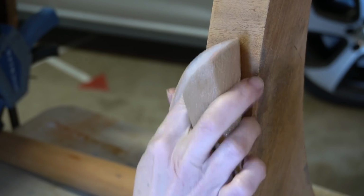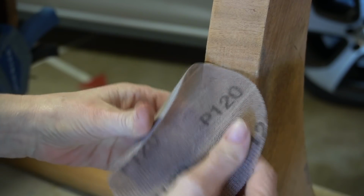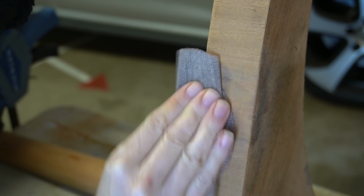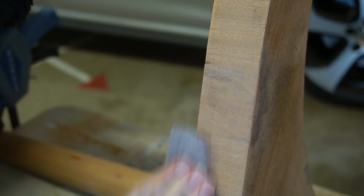I started with an 80 grit to remove the glue, going super gently. This veneer was already much thinner, so I didn't want to take the chance of screwing it up any worse than it already was. Then I moved to a 120 grit. And finally finished everything off with a 240 grit. Now, it might look okay here, but...